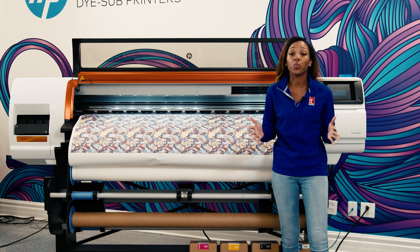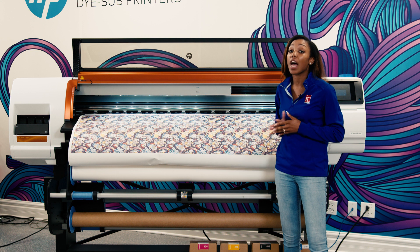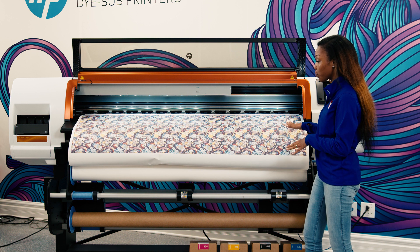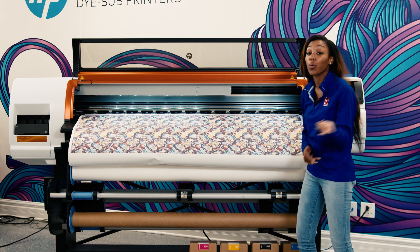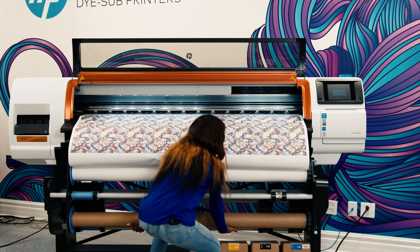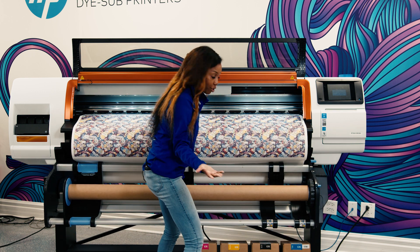The first thing we're going to do is get our take-up rail into position, so that way we can start rolling our paper onto the empty core that you see here. I've already started my image printing, but I did put it on pause, so that's the reason why my door is open here. We're going to go ahead and get this thing started. I moved my transfer paper out of the way so that I can take and bend here and lift this up until you hear it click — as you heard.